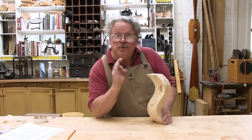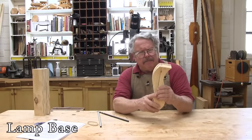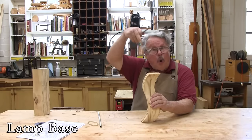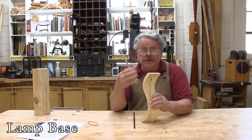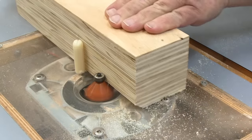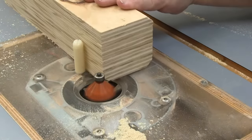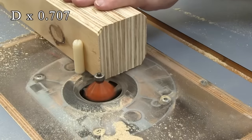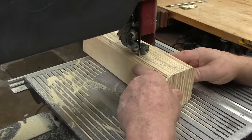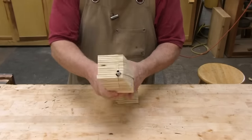The first thing that comes to a woodworking wizard's mind is that this would make an absolutely great lamp base — Lumus Maxima and all that. But in order to do that, I need a very long drill bit to drill a hole down through the center for the threaded lamp pipe — the stuff that channels the wires. Or, I could make that hole before I even start. Using a table saw or a router with a chamfering bit, chamfer the corners of the stock. If you're wondering how big to make the chamfer, take the diameter of the lamp pipe times 0.707. After chamfering the outside corners, bandsaw the shapes — make the first cut and then the second. When you rotate the pieces and bring the corners together, they will form a square cavity that will accommodate the lamp pipe.